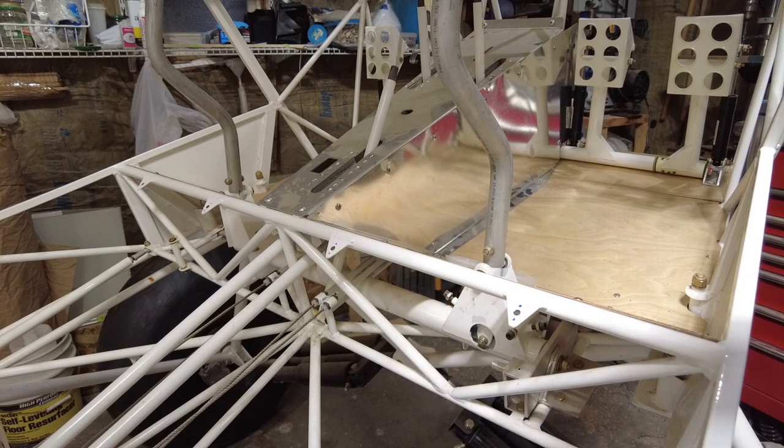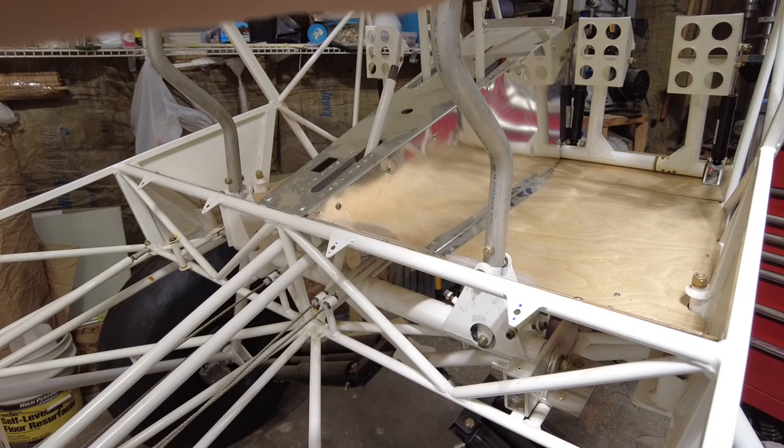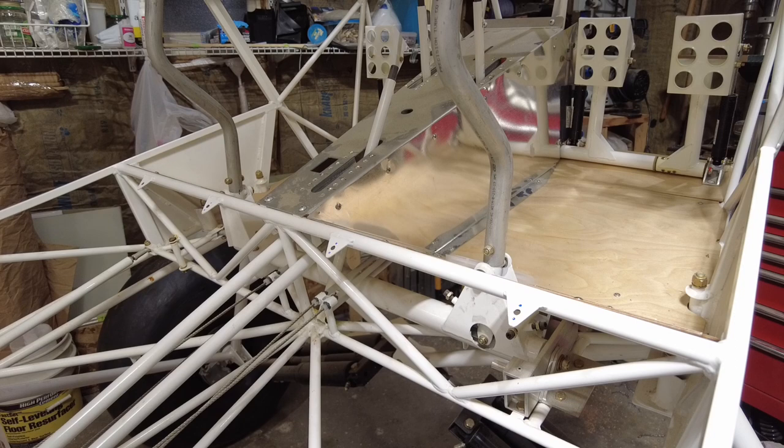I've tightened up a lot of lock nuts on the airplane that I'm gonna have to go back and replace because they have the self-locking ring inside, and I've put them on, for example, on the center console. I don't know how many times I've put those things on and taken them off, that they're certainly shot, I'm sure. Some people said that you could get a bunch of nuts from the hardware store, same diameter, same thread pattern, use those temporarily, but it's kind of a horse apiece in my mind.